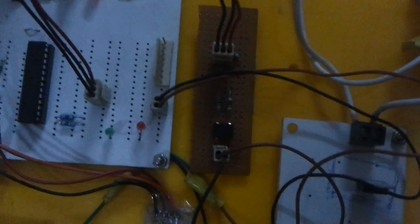The speed controlling is done by the triac circuit here. This piece of PCB is the zero crossing detector. In this project we can control the speed of this motor, and the speed can also be measured by the use of this infrared transmitter and receiver pair.